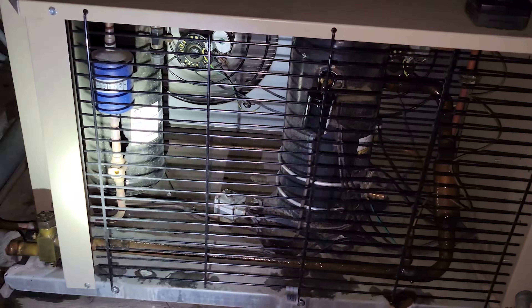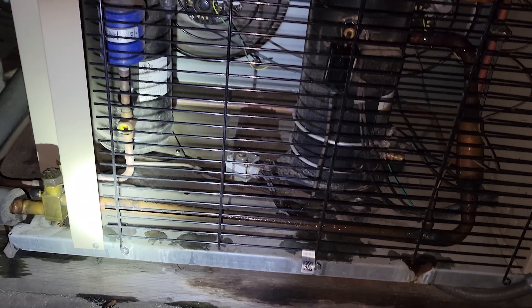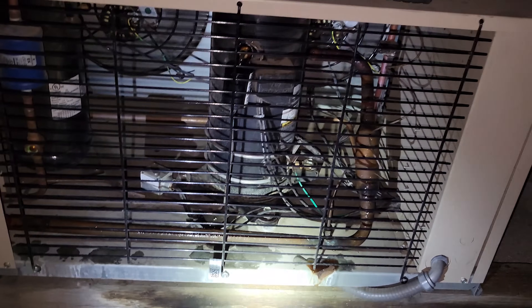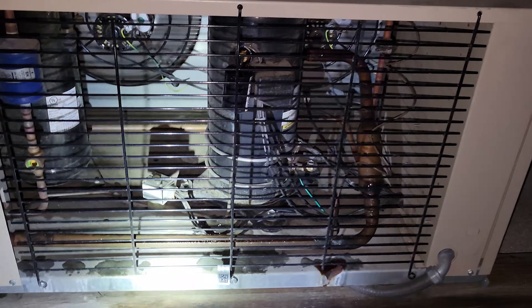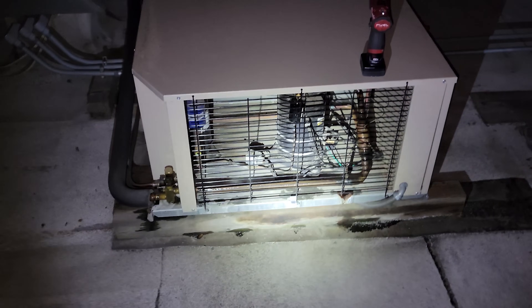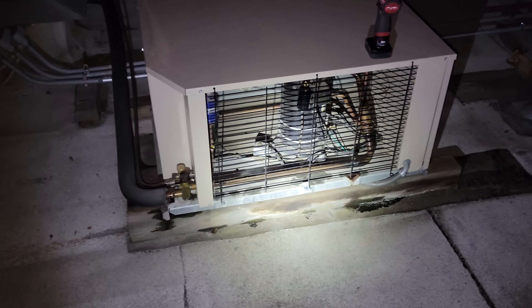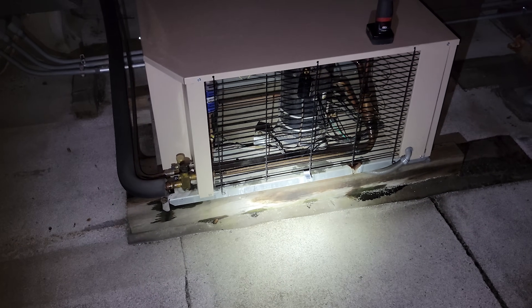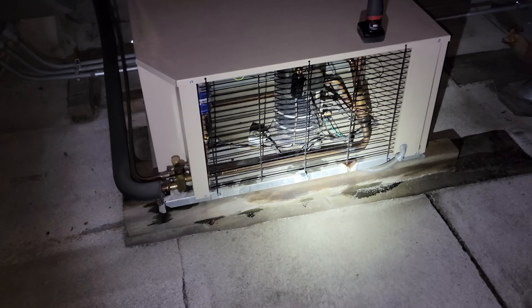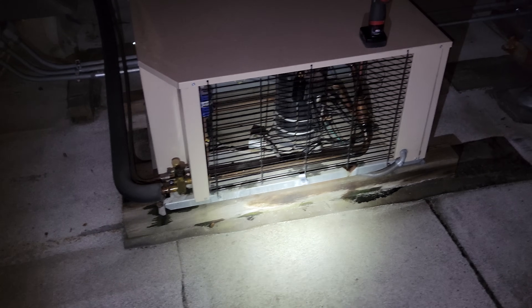It's obviously dark outside now. Equipment's running. I don't see any need to put refrigerant gauges on this guy because it seems to be operating properly. We've got a clear sight glass and the system is dropping in temperature significantly — 10 to 15 degrees. What caused that transformer to go bad? That's what concerns me. I did find that the parallel cable for the display was loose — it was like clicking and making a weird sound. When I pushed it in, everything started working.